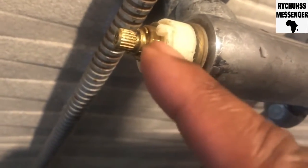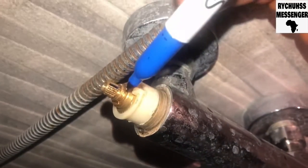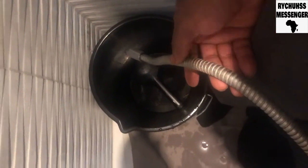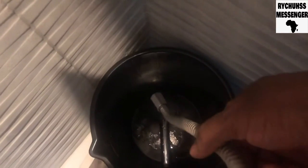This is what you are going to adjust to get the hot water back to its normal temperature — the customer is complaining the water is not getting hot enough. This is where the pen comes in handy: I'll just mark here like this so that I know what I'm doing when I'm adjusting it. I've taken out the shower head because I don't want to get wet or let water go everywhere.